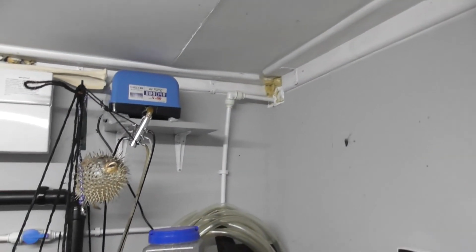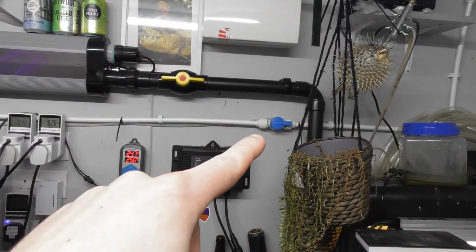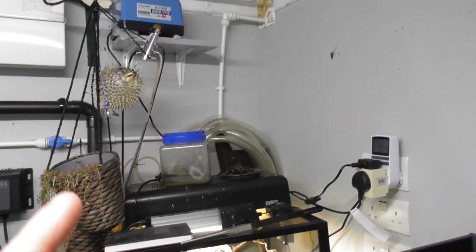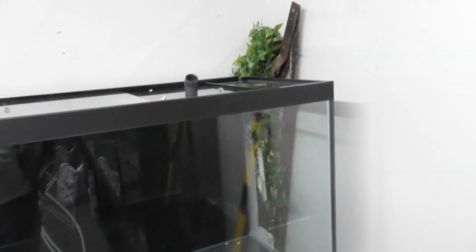Fill the tanks up, you see the white pipe coming into the fish room at the top. That tracks all the way around. You've got the blue valve here, which is my on-off freshwater fill for the 10 foot. Now I'm going to tee off of that and run mains water pipes as quick fills for the 5 foot, across the wall, and for the 6 foot. So there'll be no messy hoses for filling, and it's a nice neat job, no spillages, dead easy. So that's today's job.